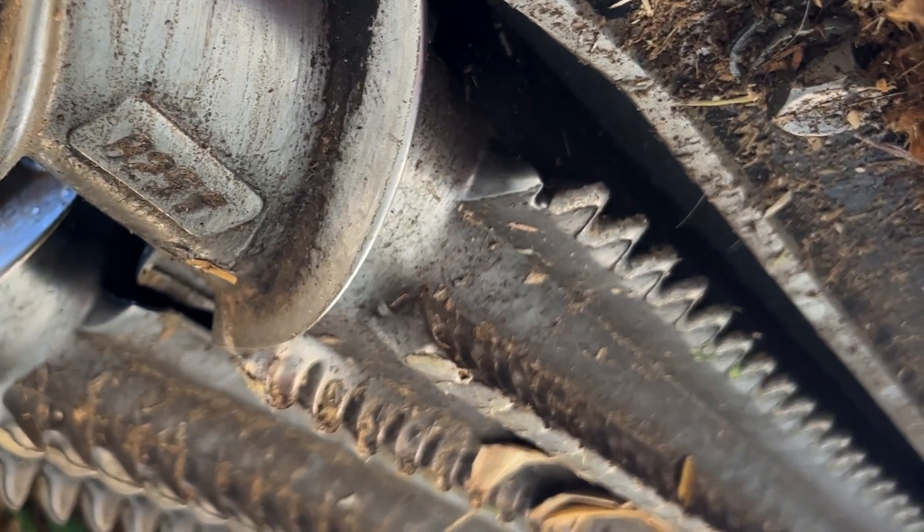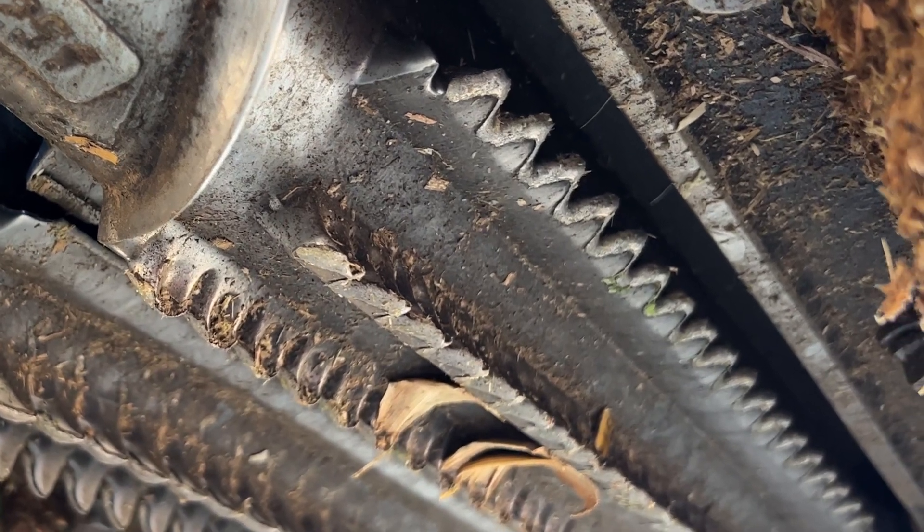Of course we had all kinds of challenges. We had challenges with stalks wrapping around the rolls — instead of being steel rolls, they became steel rolls with a heavy layer of stalks wrapped around them. That led us into trash knife development: getting knives to ride right outside the rolls and knock the stalks off and let them exit the roll and not stay stuck to it.